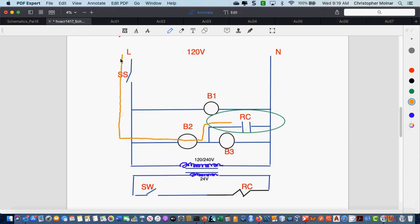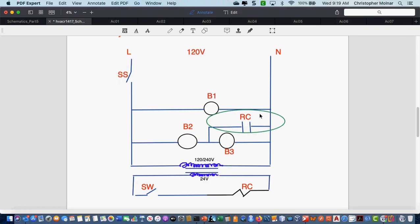Okay. So again, we have to be very careful that loads in series always split voltage, and it's dependent on the resistance of the device. Transformer primary windings have a pretty low resistance. Sometime when you get in the shop, take a resistance of a transformer primary winding. It's a pretty low resistance. So we just want to be very careful about not putting transformers in series with another load. We can put them in series with a switch, but not another load.